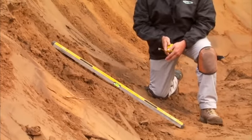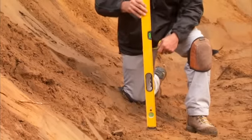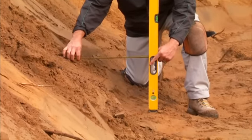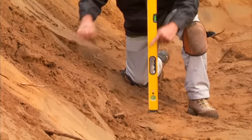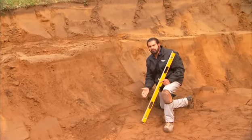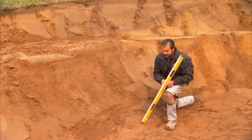This is a good sandy soil. What I'm shooting for is a thirty-five degree back cut, which would be one foot up and about a foot and a half back — and I'm good. Now if this were a clay soil it would be twenty-six degrees of back cut, which would be one foot up about two to two and a half feet back. But in this case I'm great.